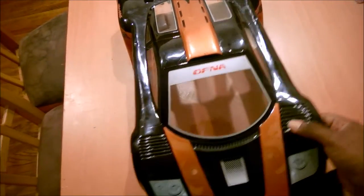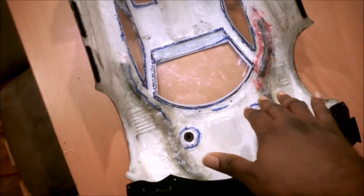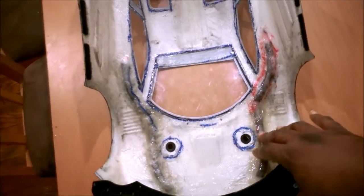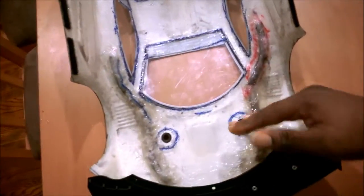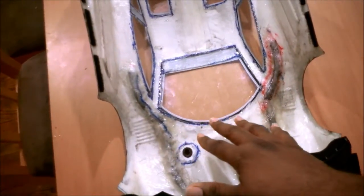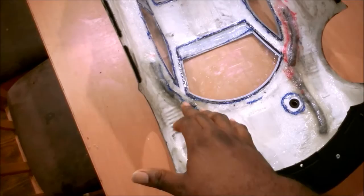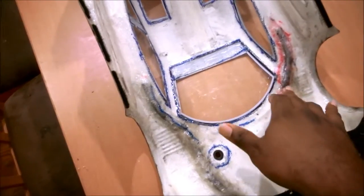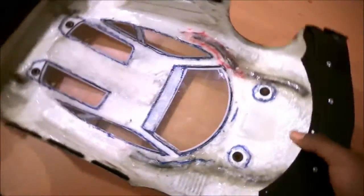At the last update Kyle and I did together, I showed that my little I-beams came up and they dumped load a little right around this area — there was still a little pull point here. To remedy that, I went ahead and used the same method and extended the I-beams all the way down into the actual body of the car, which is much, much stiffer.